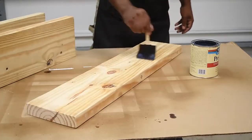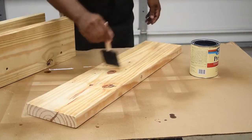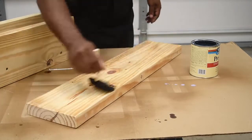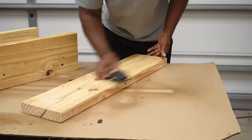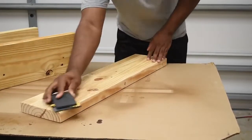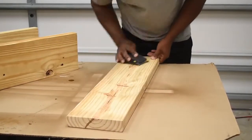To prep the shelf to take the stain I'm going to use one coat of Minwax pre-stain conditioner. For viewers not familiar with pre-stain conditioner, what this does is help avoid any blotchiness from your stain. After the conditioner dries I'm going to lightly sand it down and then the next step will be adding the stain.